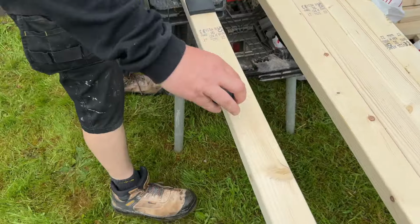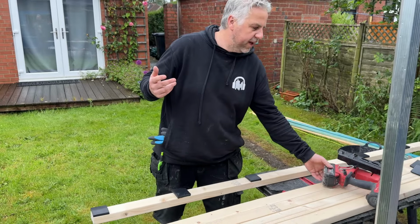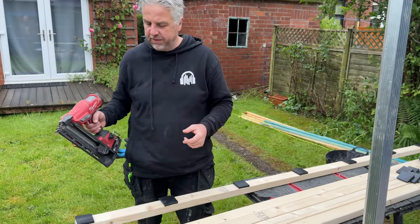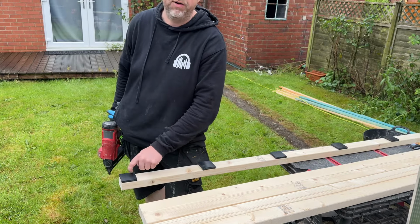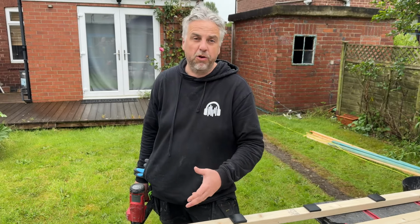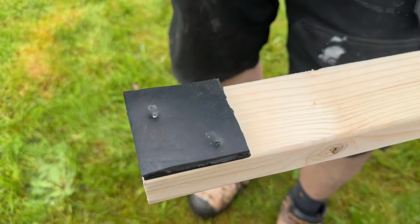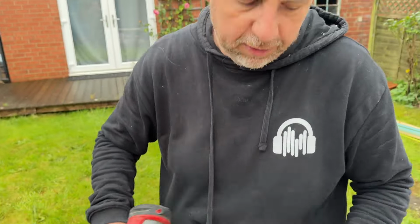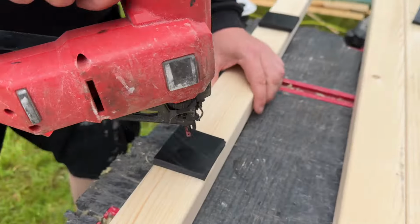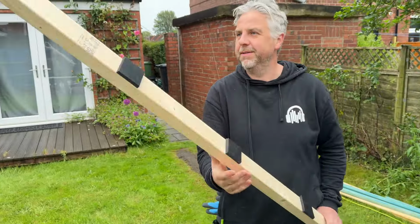Now we've tried all different ways of actually connecting the rubber to the timber. Gluing it can work, but obviously we're always working pretty quickly. So what we found the best way is using some really small brads, which are going to countersink into the rubber, so it's not really touching the floor. We've tried screws, but sometimes they can be a bit more proud and come off. So yeah, the brad seems to be the best thing. What I'll do is I'll countersink this a little bit more. That goes a bit further. It just sits underneath the surface. Okay, so if you follow me, that's all sorted.